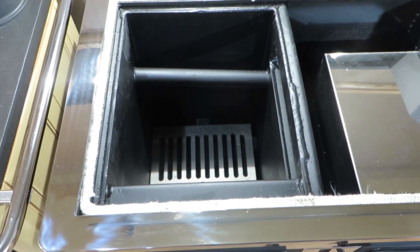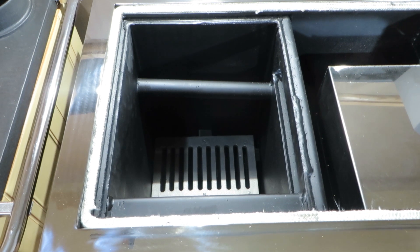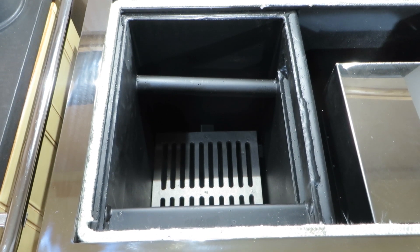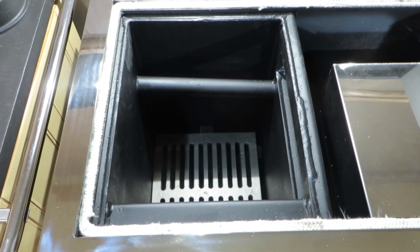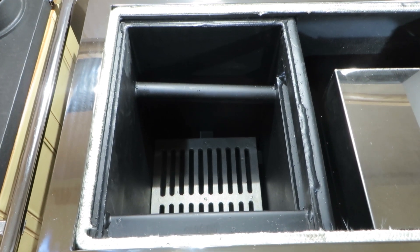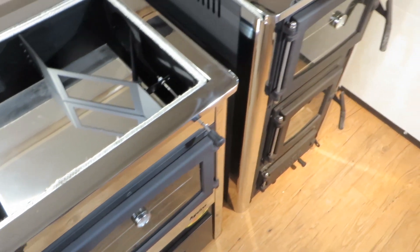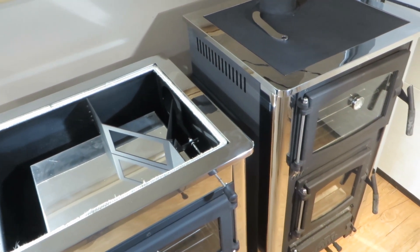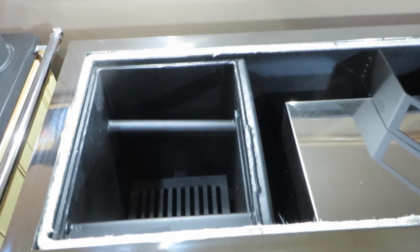This is the Hydro version of the Concept 2 cook stove. The Concept 2 has an interesting firebox in and of itself when it comes without the boiler option — it's fully lined with fire brick, with double layers at the top, so it's got a reburn. We think it would probably pass EPA, which gives you a clue about this company: they're very in tune with efficiency and clean burning. The Concept 2 Mini is an extraordinary stove — very large firebox, very clean burning.